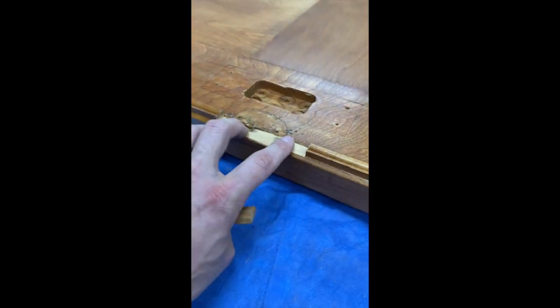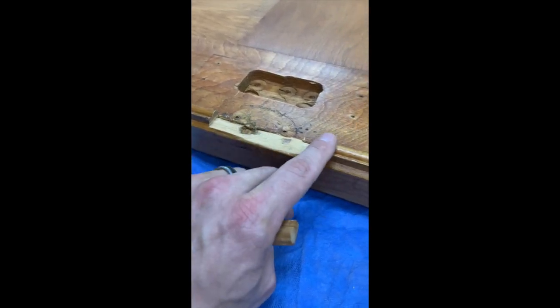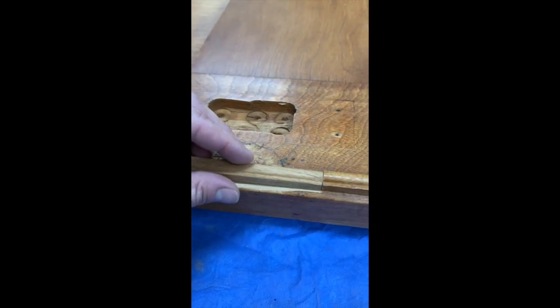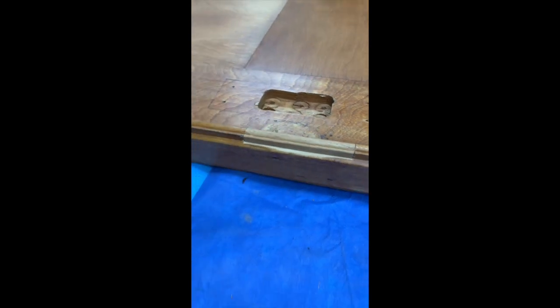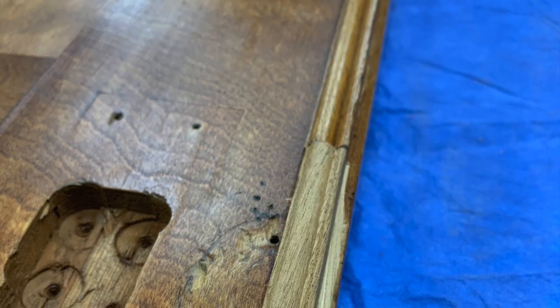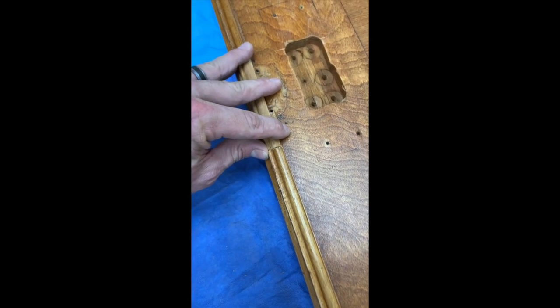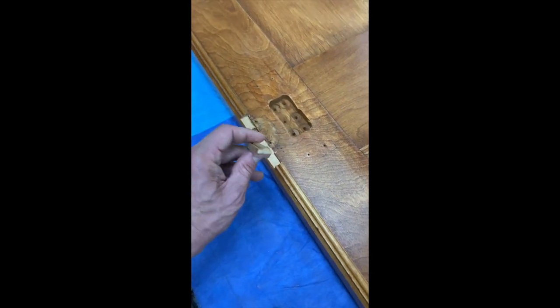Now, we took this door and where this piece had been really kind of jobber-wonky out of here, we cleaned that up and took our new piece made with our Swedish scribe — and you can see it fits pretty good. What I'm going to do now is glue that into place and let it sit overnight. The wood color is close, and then I'm going to try to match the stain and touch that up, especially around this little edge piece, to hopefully hide it just a little bit better. Still a little bit more work to do, but pretty happy with how it's coming out.